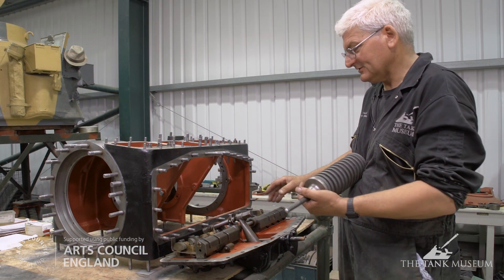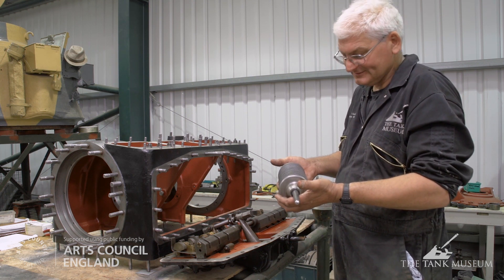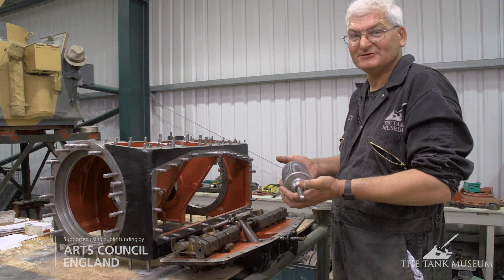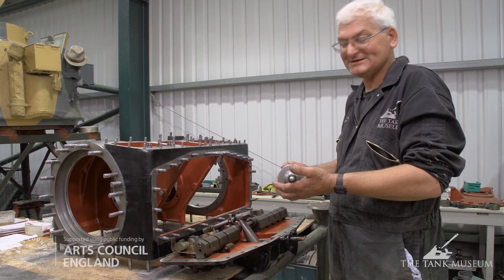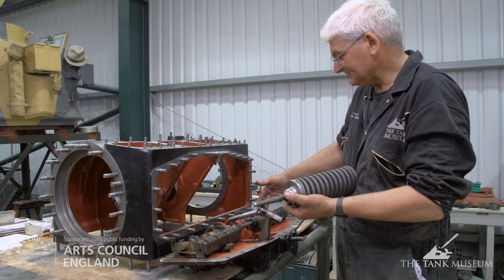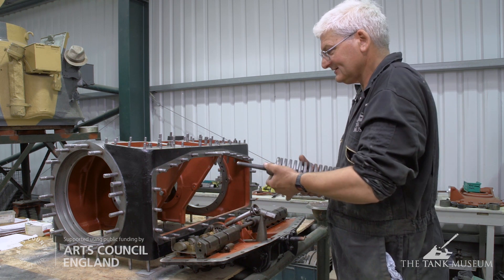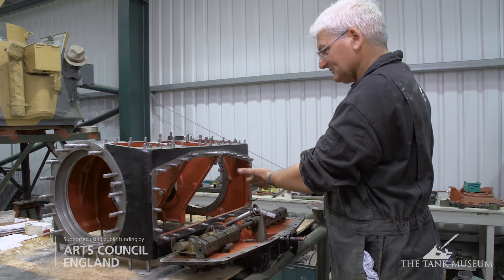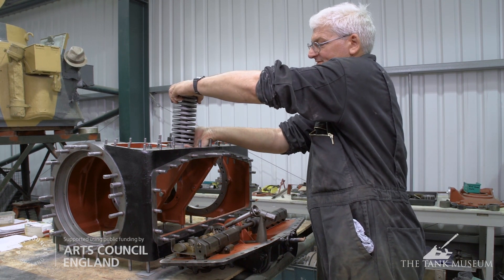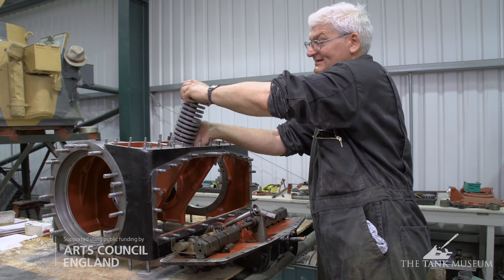This is the selector mechanism for the gearbox, which selects the various speeds as required. It operates in conjunction with a thousand-pound spring, which can be a bit dangerous when you take the gearbox apart — as long as you're aware of it, it's not a problem, but if not, it could come flying out and do damage. There's a set of cams which operate the various brake levers and an interlock so you can only ever select one gear at a time. This basically bolts onto the rear of the gearbox as a base plate, holding all the brake bands, and sits in the centre of the gearbox, providing all the pressure which holds everything together when the gears are operating.